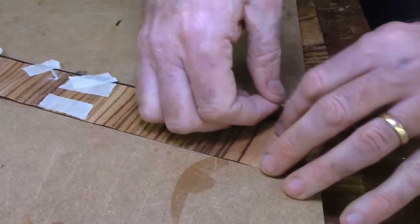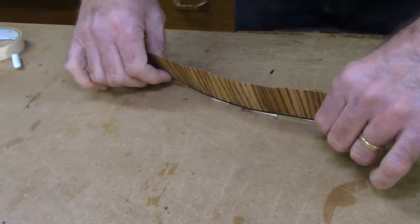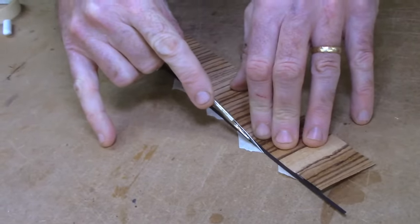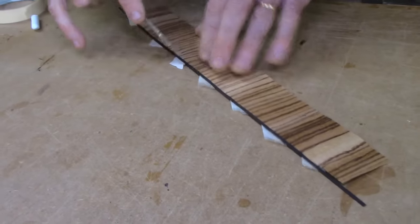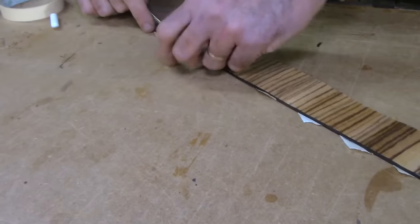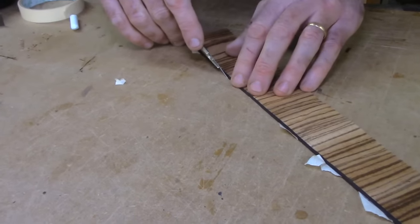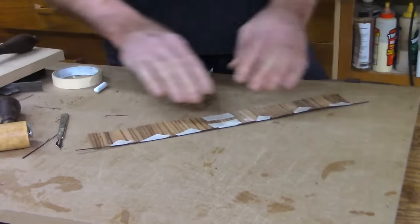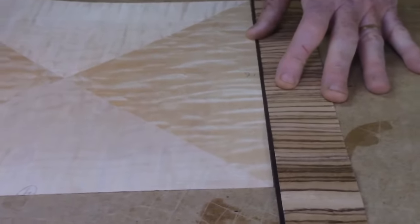Once taped, I flip it over and come in with the scalpel to remove that backing tape — just leaning right against the veneer. There's our line on the border strip, with the ebony face side out. You can see what a difference it makes — beautiful! I'll put the scalpel in the description since a lot of people like that tool. Now I need to miter the corners of the border. I want a 45-degree miter — this angle is actually 135 degrees — and I line it up with the edge to make my miter cut.